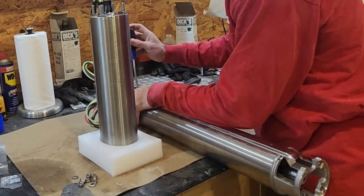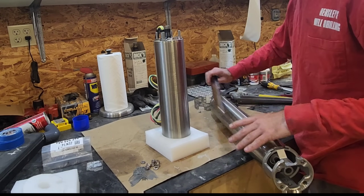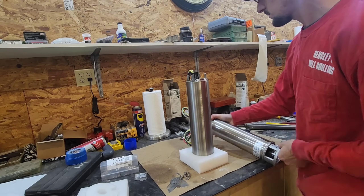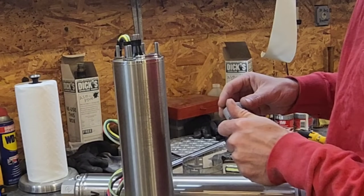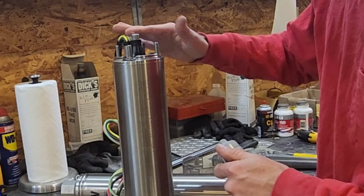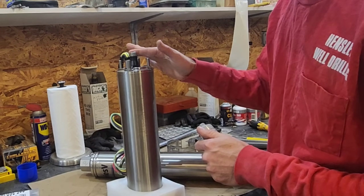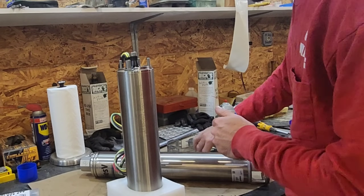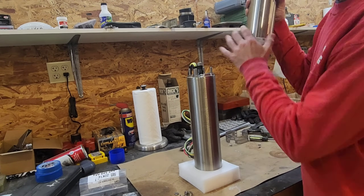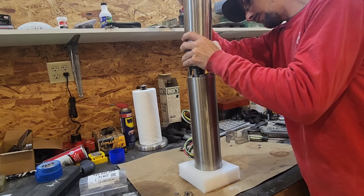The wire guard is interfering so we also have to take it off. I'm going to take just a little bit of lubricant and put that right there on the splines — just a little bit of silicone. It will help this seal and help the first stage go together better.